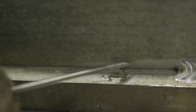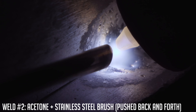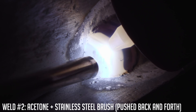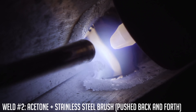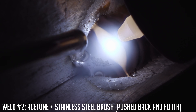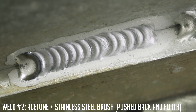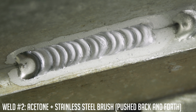As you can see, this is all the aluminum oxide and surface contaminants being pulled off. You can physically see this stuff. But if you're using the wire brush incorrectly — pulling it one way and then cramming it back into the base metal the other way — once you weld on it, it's just going to get pulled to the surface again. You'll see it in the weld as you go across it and in the final product. I had small little black peppery areas — again, due to improper cleaning, even though I used acetone and the stainless steel wire brush.